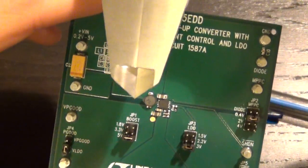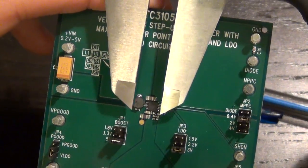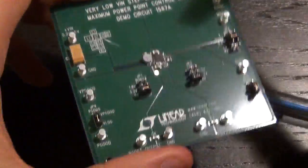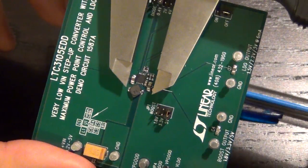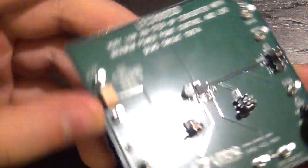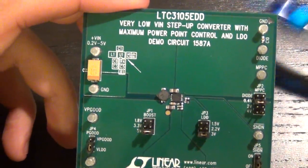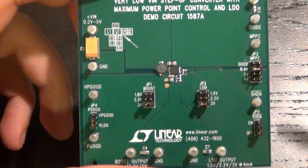The actual circuit is really small. If you were to measure how much area you'd need for the circuit itself, you need only about a 10 by 9 millimeter area to completely implement it, including the inductor - which is very, very small. So it's very good for portable, tiny distributed sensors or other kinds of applications.